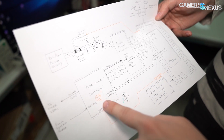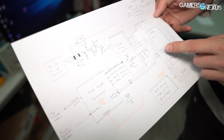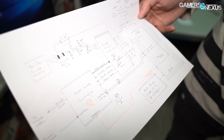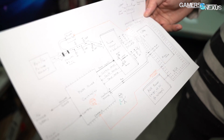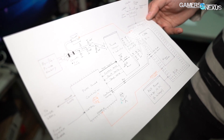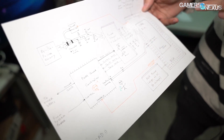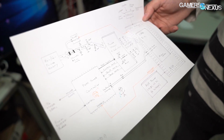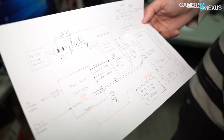This all happens within the controller. You tune the controller which has different adjustment knobs — like frequency, which controls how often the monitoring loop runs. You can also artificially tell the controller that the real voltage is, say, 50 millivolts higher than it reads, and that correction will be applied to the whole voltage. Switching frequency is one of those key knobs, and it affects transient response and overall VRM speed. On older motherboards and VGA cards, you often need to increase switching frequency so the VRM can keep up with the demand from the GPU die.